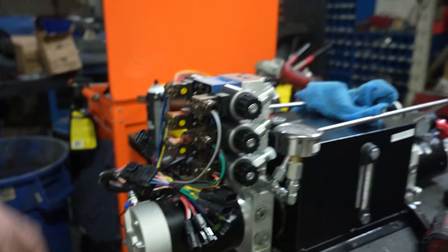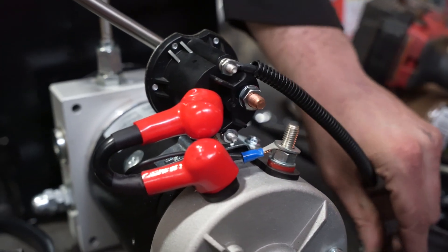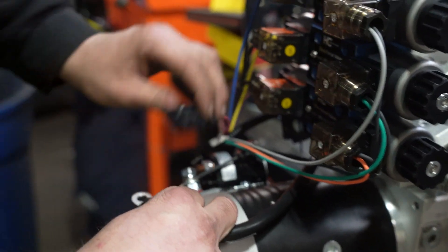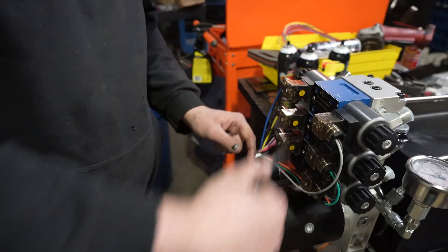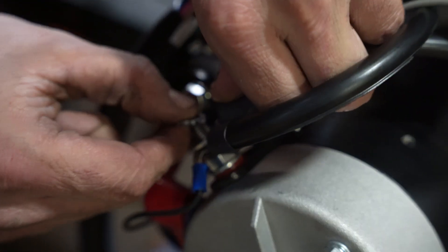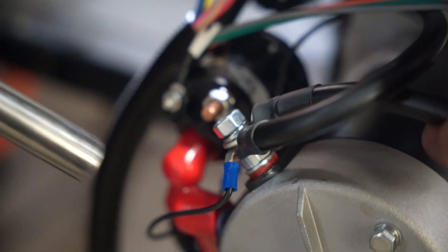Pop and that's it — wired and ready to go in. We do have to put our power wires on for our motors though, so we'll get right into that. Loosen this post up, set that to the side, grab our longer ground wire, slide it on there just like that. Now feed this up through here, give it a little turn and a bend. Take that, then grab our smaller wire — feed that right over the top, compress all that down, get our lock washer, get our nut, thread it on. Pull this up just like that — tighten that. This is going to go to our ground on our battery.